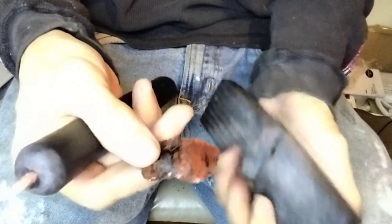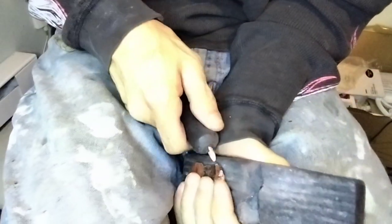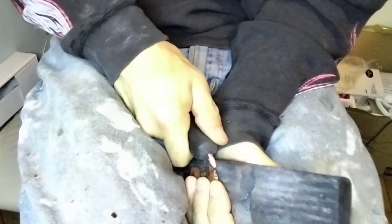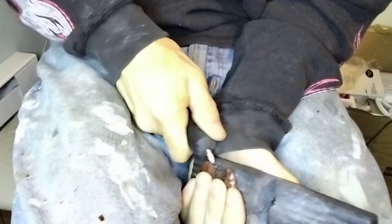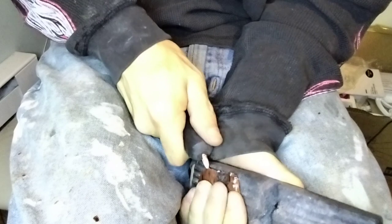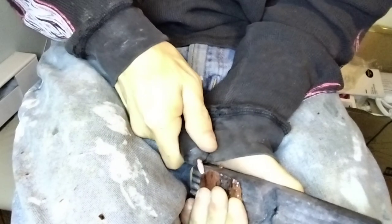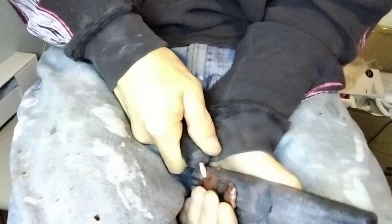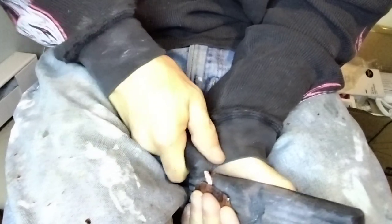You will get the perfect pressure later on. That comes with time. Now we're going to flip it over, do this side, this edge. Actually, let's stay with that side. So I'm going to create a continuous platform all the way down this side now, just by scraping that edge, lifting the edge. You want this edge to be even with the top again, like we did before. You want to get rid of all that really thin, sharp material.